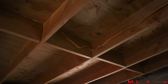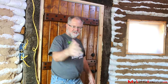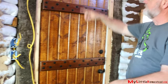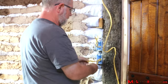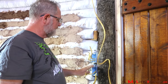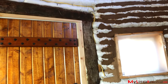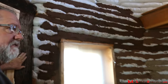Usually when you do a door, you put your rear end of the door and figure out what's right. It swings, so this would be a right-hand switch. We had to move the electrical switches from one side to the other side of the door — miscalculated that, but that's okay. We can move it to here. We have wire that runs from this box to this box, so this will be our power side. I'm going to wire these two together and put covers on the boxes, then send a wire around here to power a switch for the fan light in here and a light outside.